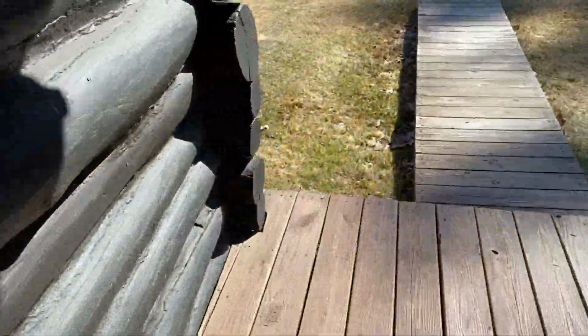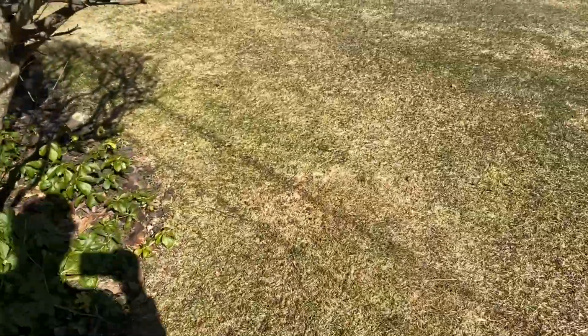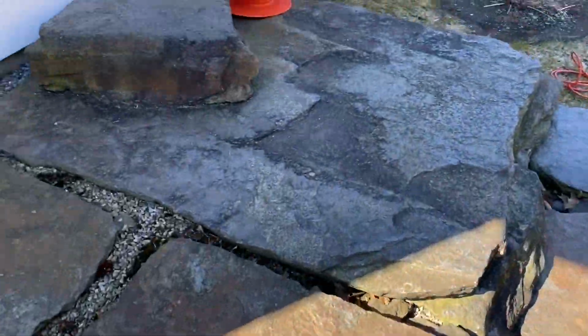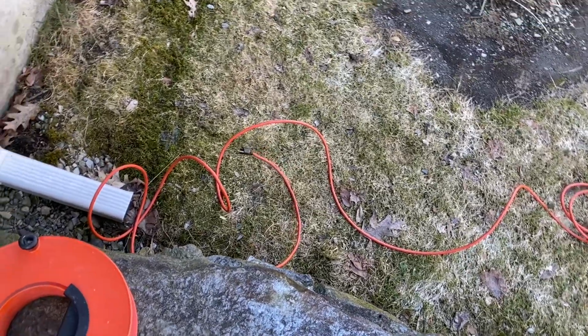And I don't want the water to drain back through the line this time. That's what took all the time. And that's what created the whole bubble scenario. So this time, I'm going to shut this off first. That keeps the water from draining back down through there with siphoning action and sending our water back to the river. And then I'll come over here, unplug that little bugger, and it's ready.